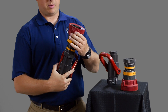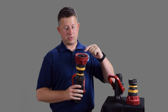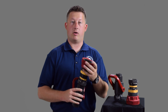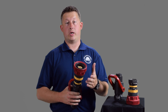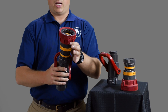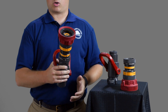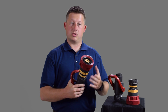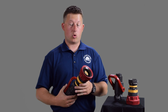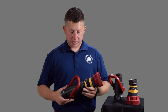I also want you to see the stream shape here. This nozzle in particular has a thumb indicator. In a lot of nozzles you'll see, you have to rotate the nozzle pattern adjustment several times to move from full fog to straight or straight to full fog. This nozzle has a thumb adjustment, and when you turn it, it goes all the way from fog to straight in about a quarter turn. There are several nozzle manufacturers doing this now — it's a really nice feature because it's a quick adjustment, and you can feather the pattern really nicely to adjust it.